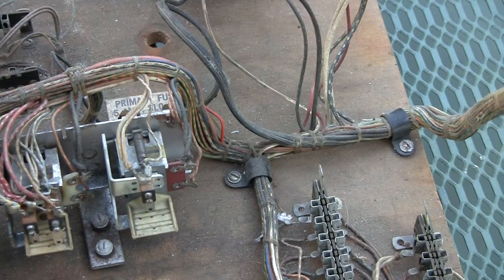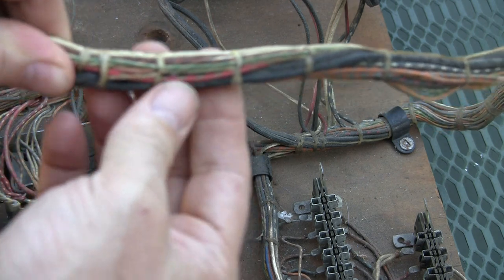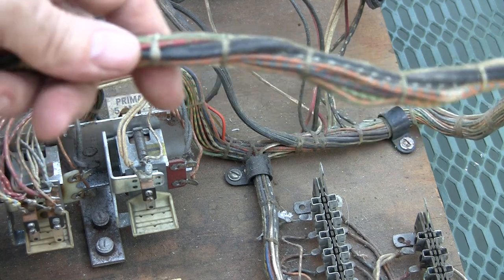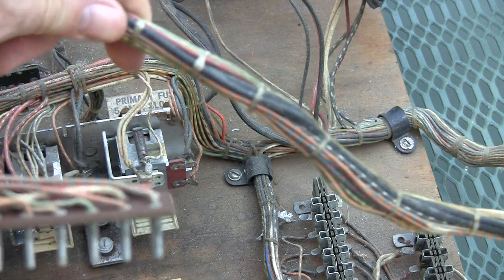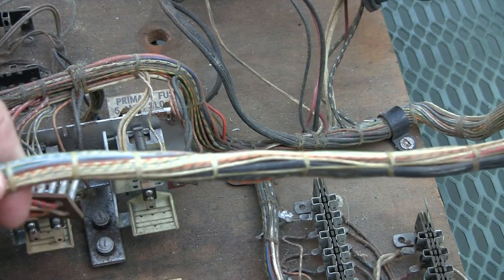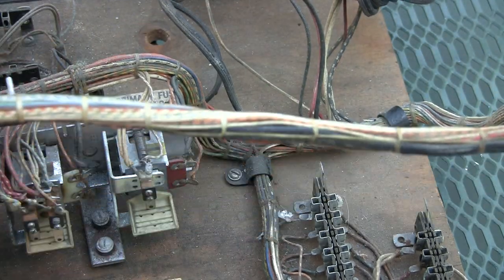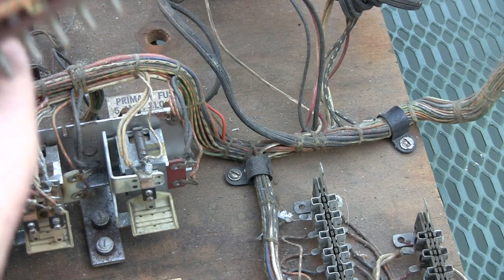Now these old wires are really quite pretty and beautiful if you get a good look at them close up. It's all cloth wound in these old games — beautiful cloth — and this is actual cat gut that they're wrapped in. You can see it still holds up today; this is a 50-year-old game almost, and this stuff is really solid. Probably copper in the middle and then the cloth is around it. Each of the color codes has meaning when you look at the schematics, when you want to try to find where wires are going through the game. And then at the end you'll see these things called Jones plugs.